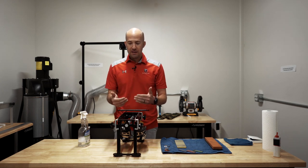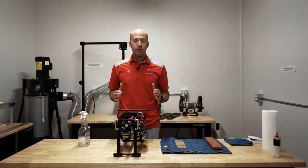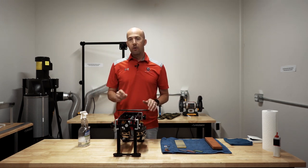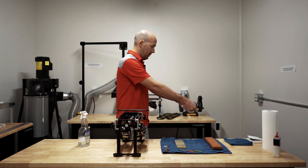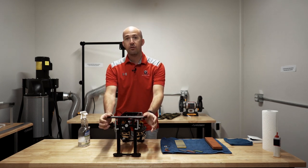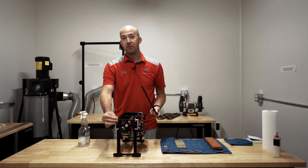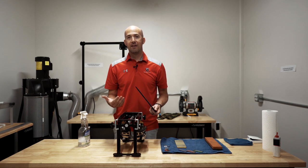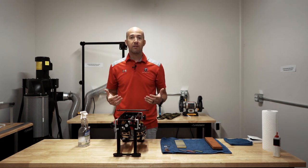Another thing to think about while you're sharpening is that your blades are actually round and the stone is flat. So while you're sharpening you want to almost seem like you're sharpening a ball — you want to move the stone in a round pattern because the round blade and the flat stone only interact at one point. What we can do while we're sharpening is when we go to the end while the stone is over the end of the blade, if we have pressure back towards ourselves we aren't actually sharpening the last two or three inches of the blade. So we want to make sure we have that feeling of sharpening a round object, because our blades are a round object.